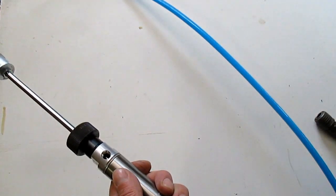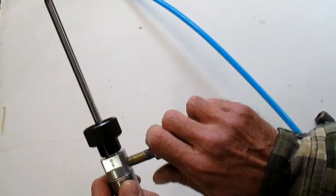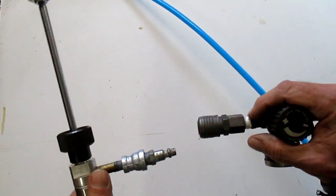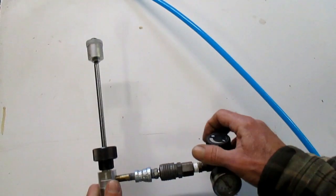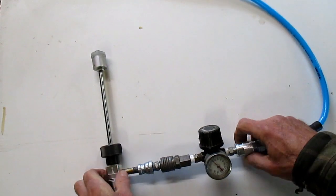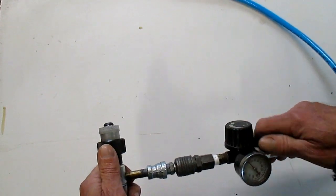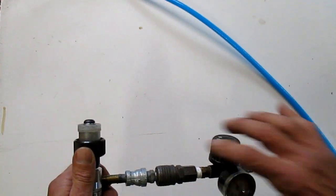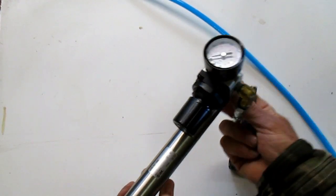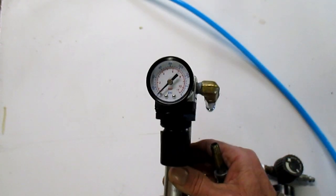I made up a little fitting for the retraction procedure. I get my air adapter on it like that, hand-feed it in, and I have a spare regulator so I can back the pressure off and attach it. Then I just do the opposite — take my air hose, put it on the bottom port, apply pressure there, and it pulls the shaft right back in with no fighting. I just hand-thread that plug out, which lets me look into the hole and see the mark. That'll streamline the whole process.